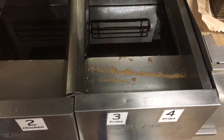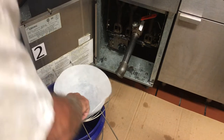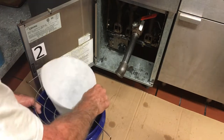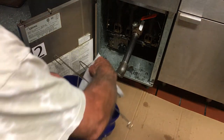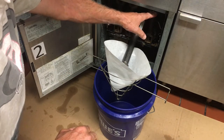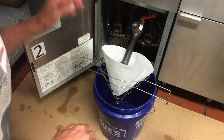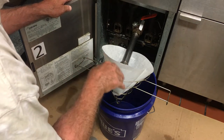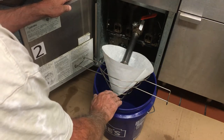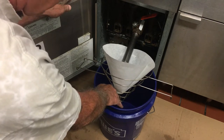We've turned our paper filter inside out and dropped it on the holder. Now you're going to tilt the funnel into the bucket, then crack that valve just enough so it drains into your bucket but doesn't overflow. Don't go walking away washing dishes — monitor it, make sure it comes to an equilibrium. Once your oil gets to the tip of the cone, you're going to have to shut it down.